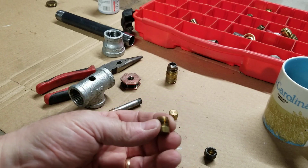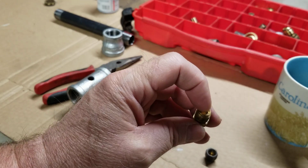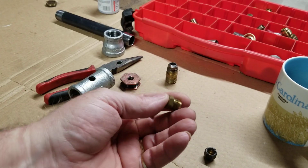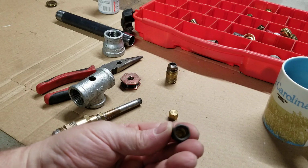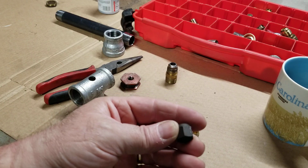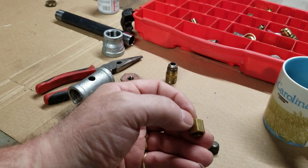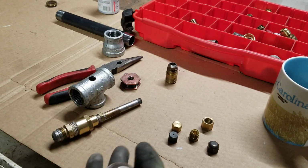Maybe one of the things about these is the thickness of the last part of this. Maybe reduce it by finding a drill that fits in there as clean as possible, and then drilling them out just so that you're not drilling too far with the 60 wire drill. Just a thought. You can do it with these kind of caps too, but it's got more of a flat bottom to it. But there's a chunk of brass here on the cap that probably needs to come away. The nozzle doesn't have to be in the 1/4 of an inch of solid brass through the bottom there. Just a thought. We're trying to make a gimbal here kind of deal.